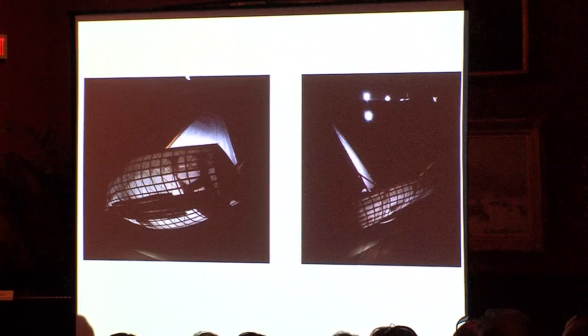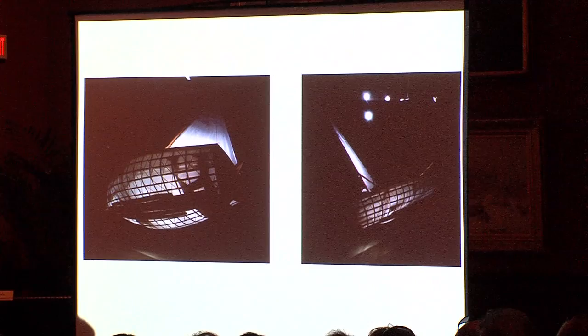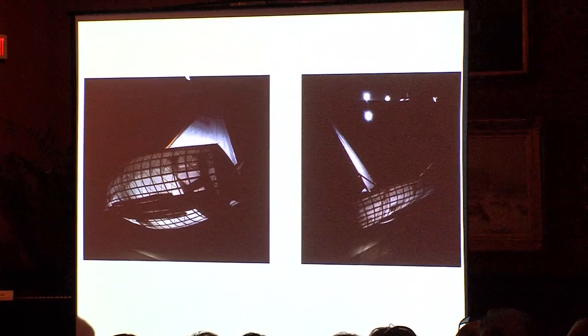One of the main differences is the use of measurement in furniture making. People are extremely, extremely precise with furniture building, where they rely on measurements all the time. With boat builders, there's much more use of relative measurement, where something is measured relative to a curve and relative to the prior piece you put in, and the epoxy is used and things like this. Like, different methods are used in boat building that in furniture just would never fly.